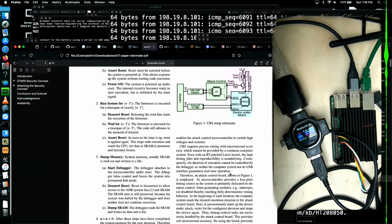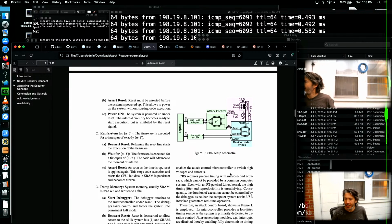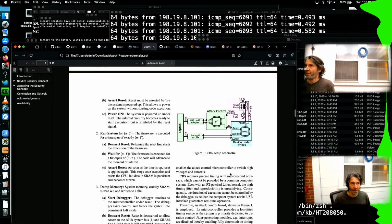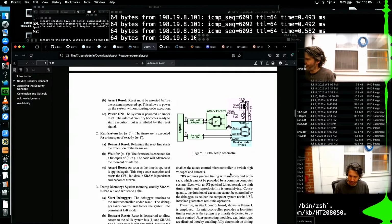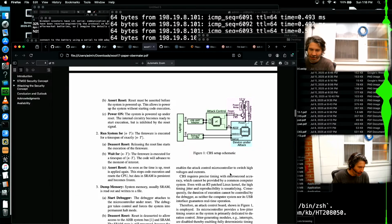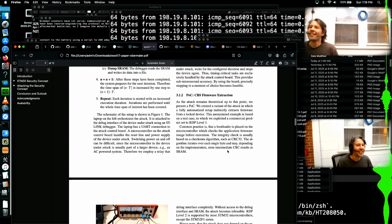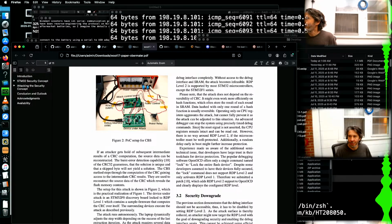Basically, in these embedded processors, a lot of times data and instruction caches are separate. And so the readout protection only applied to the data cache. So they were able to jump through some hoops and exfiltrate data through crashes, with data coming out through the instruction bus somehow. So, these hackers, they get the stuff. There have been different flavors of getting around that readout protection.